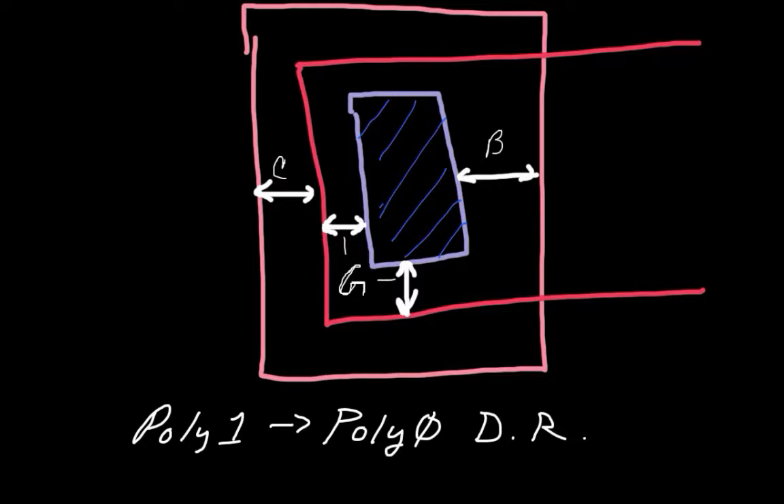Here's the left side again — these are the design rules that are important. You have a distance design rule B, so you can pull out your PolyMUMPs design rule manual. This shows the enclosure of poly zero to the anchor one. You don't want to put your anchor too close to the edge of poly zero. Since this layer follows this one right away, I think the enclosure rule is four microns — so you have to have at least four microns here, you can have more. Feel free to design more slop into it, more tolerance — make them five. That's fine.